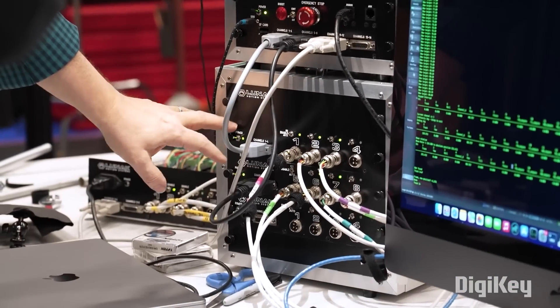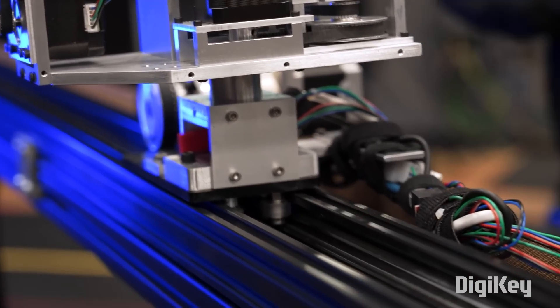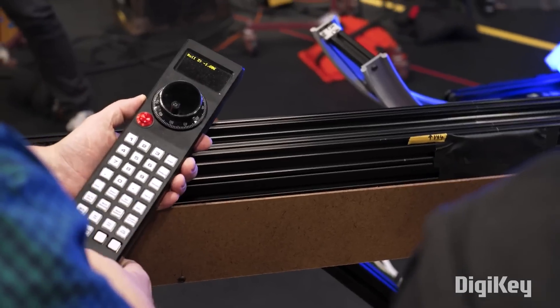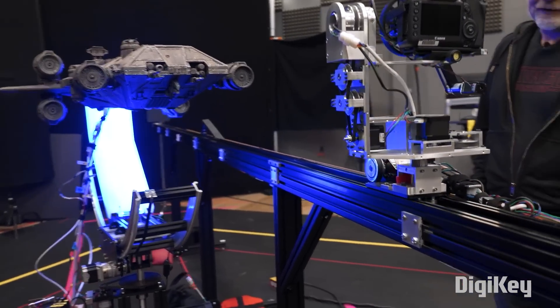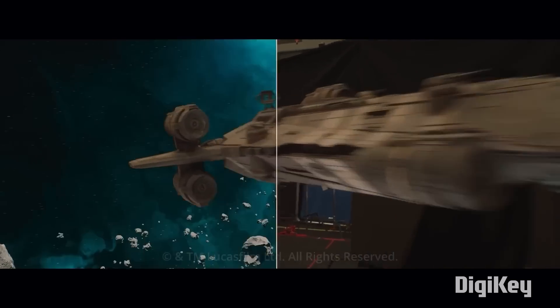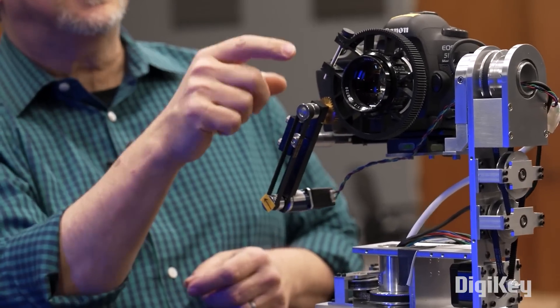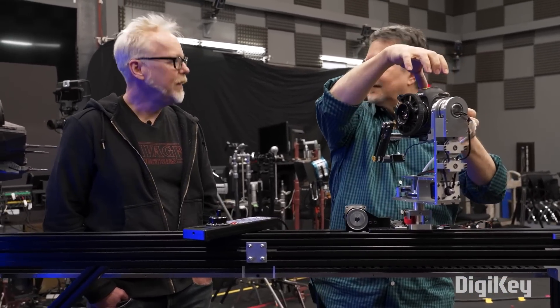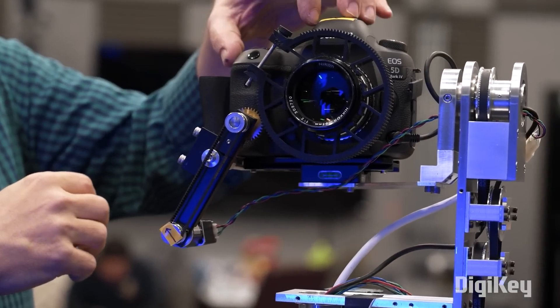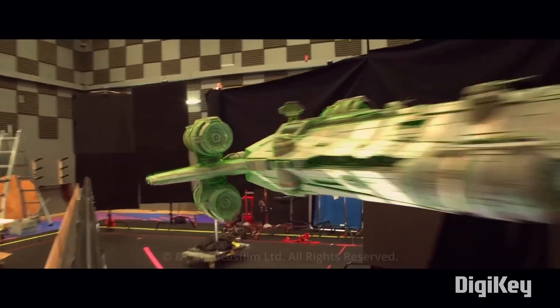Powering this entire system is a Teensy microcontroller. Most of the linear axes are made from aluminum extrusion, and even this control board looks like a really custom job. The other big surprise here is that you would think shots like these are captured on a high-end cinema camera, but instead he's using a fairly pedestrian Canon 5D. These shots aren't captured in real time, but instead are long series of still photos, which gives the visual effects compositors more image resolution to work with.